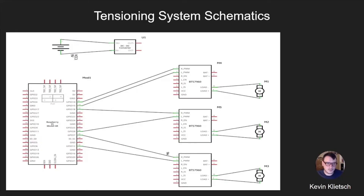This is the circuit diagram for the DC motors themselves—the same one as shown previously, just the Raspberry Pi with each of the three motor driver boards and a motor each attached to them. At the top, for both diagrams, is a simple inclusion of the buck converter that we will be using to step down the 20-volt patrol batteries to 12 volts for our system.